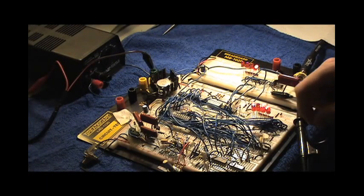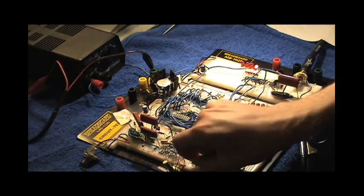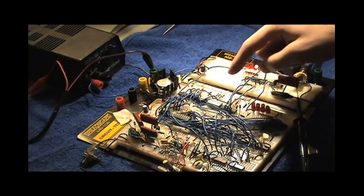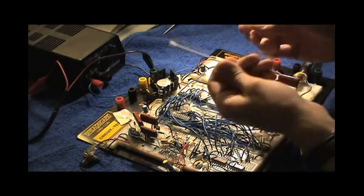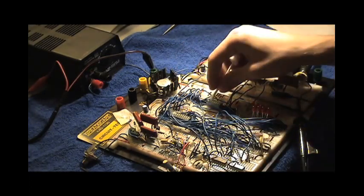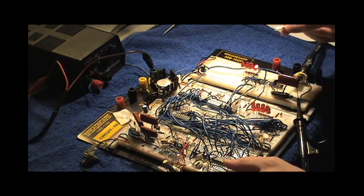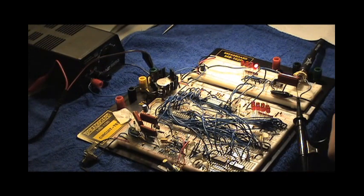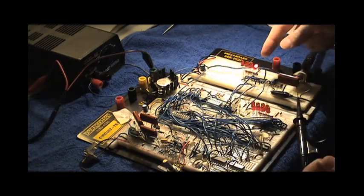Okay, so here's how it is programmed. First of all, it's put into program enable mode, with the RAM selected. Now I'm going to use this beautiful Q-tip to flick the data switches, because they're kind of sunk into the stupid thing. But anyway, right now we have one. Here, let's see, how well is this showing up? Oh, it's decent. Okay. So in address 0, we have 1 on the data bus.